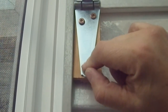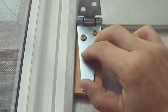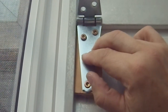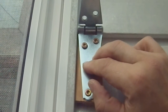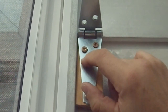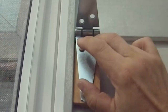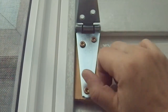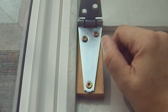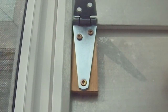I'm going to try the other side and see if that looks any better. This project may have to get stalled until next week because I'm not going to the hardware store. I figured there'd be framing around this window, but apparently there isn't any real framing around it. If the other side doesn't look better, I'll have to come back next week with some five-inch or six-inch screws instead of these three-inch ones. This house was not constructed by geniuses.